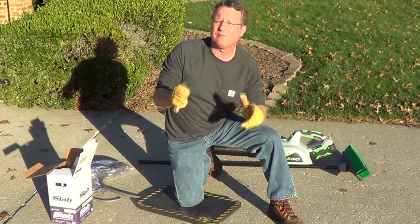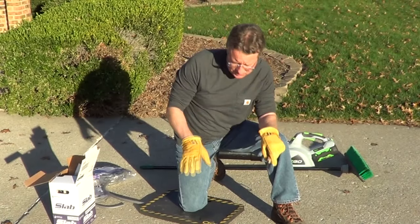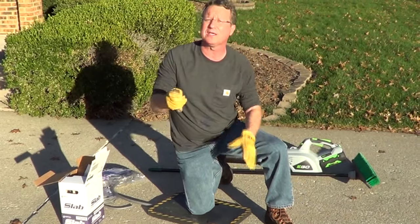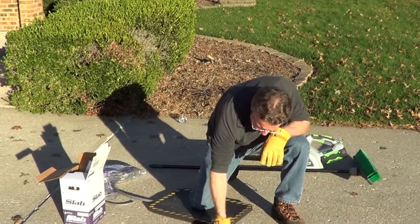To fix a crack in a concrete driveway, if you have any old or loose material, you'll want to get that up. If you've used a previous concrete patch, you might want to use a masonry chisel and a hammer to break it up. If you have old caulking, just use a scraper or an old slotted screwdriver and make sure you get it all up.